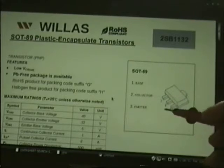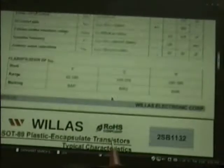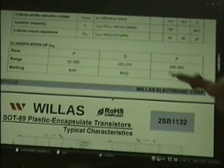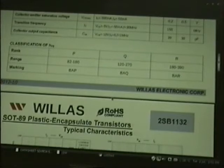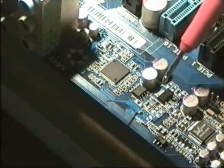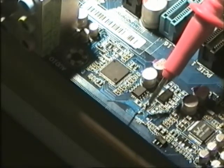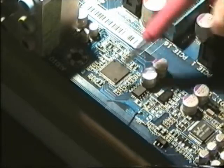Your emitter, your collector, and your base. The reason it says BAR on it — well it does on mine anyway — if we go down here we can see where it says BAR: it's supposed to indicate gain, that's what it's telling you, it's an HFE thing. They put different things on — I don't know why they didn't print the number on, seems a bit strange. That's the network controller there, and there's the Atmel chip. This transistor's doing the regulating for the 1.5 volt rail, and this one — which I've taken out now, there it is, the one that says BAR — is doing the regulating for the 1.8 volt rail.